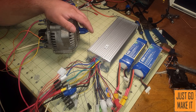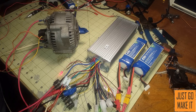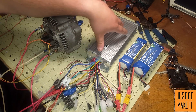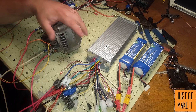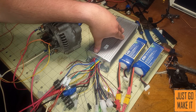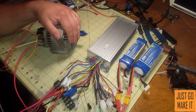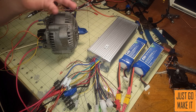I've had tons and tons of questions. One very common question is: can you power this directly from the batteries without any kind of speed controller? The answer is no. This is basically a three-phase AC motor at this point, so you do have to have some form of controller to do the switching of the phases to control the motor.